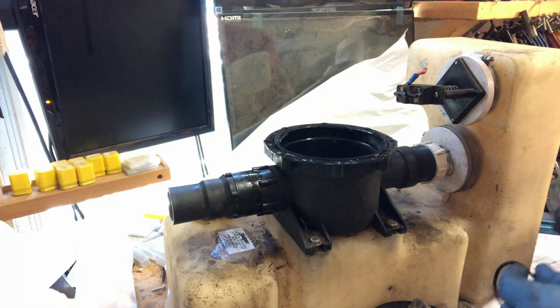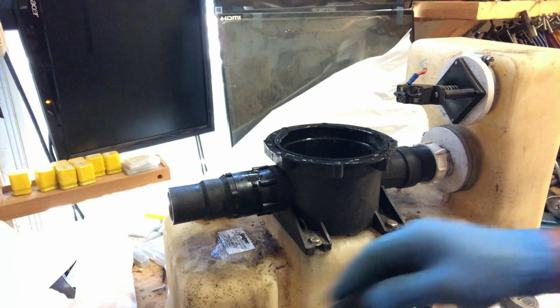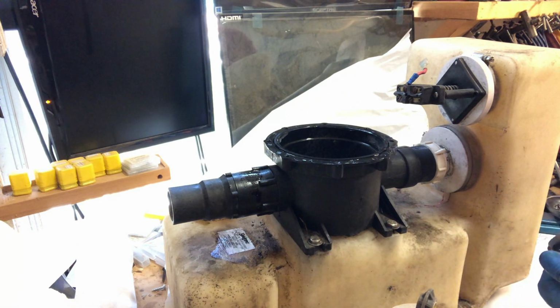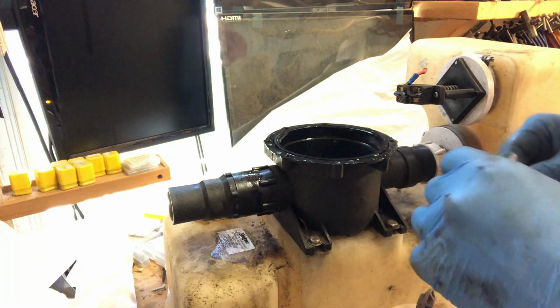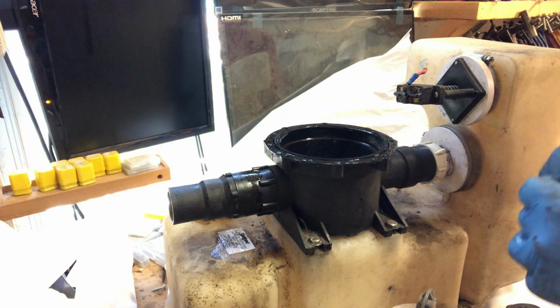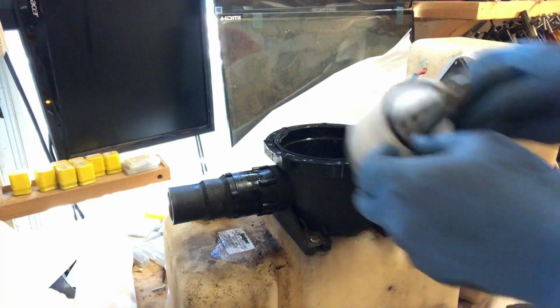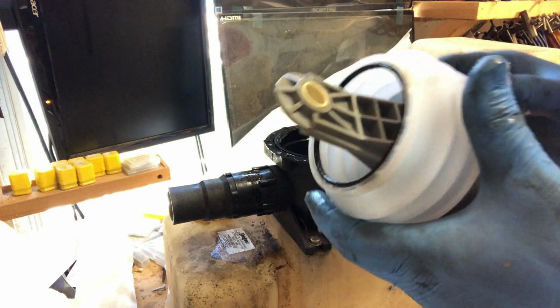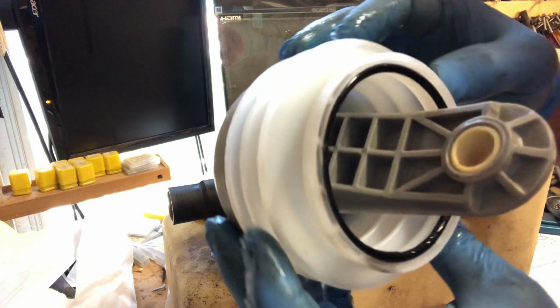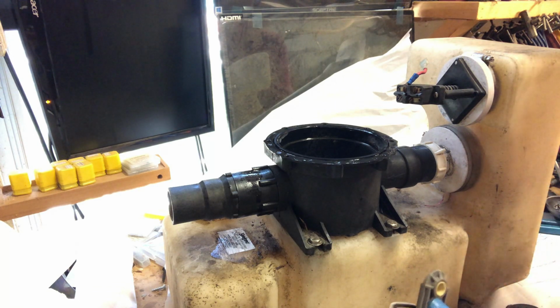This shows us, this wants you putting this seal in on the top of the bellows instead of on the nose of that top cap. So that's what we're going to do. We're going to grease this up so it stays in place too. Okay. So we're putting it right here, inside edge of that bellows assembly. I don't know if you're getting a very good shot of that or not. That's what it looks like. There's a little groove. Okay.